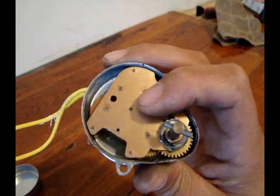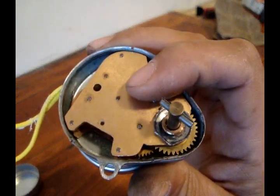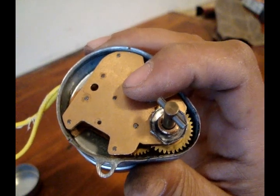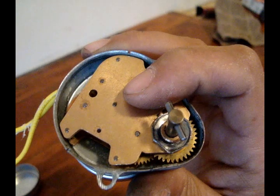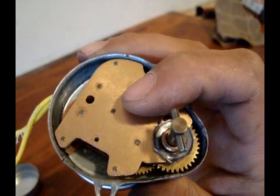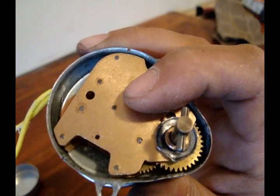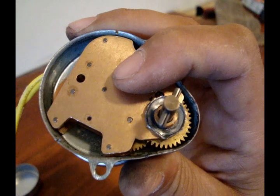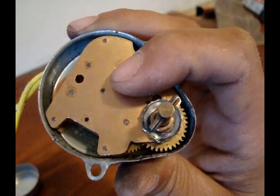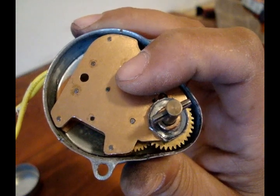Go ahead and turn the power on — you can see the gears moving. This little T-shaped shaft on the top is what closes the damper; it attaches to the shaft of the damper. As you can see it's working right now. It gets to a certain point where it will actually stop. Without the damper connected to it, this motor should just spin and spin and spin — there's nothing to stop it.